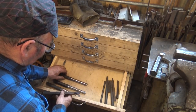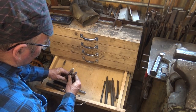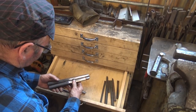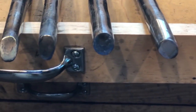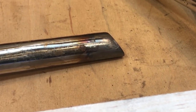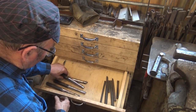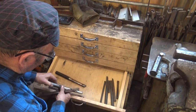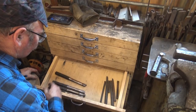These, on the other hand, we'll look at in more detail when we do some axe forging. This is an idea from James Austin — he actually sells some tools like this, though it takes a while to get them because he's really busy. These are somewhat of a chisel for cleaning up the inside of an axe eye that might have a burr or an uneven area in it. There's one oval and one round. I have just two sets of these for various axes, and they're made out of S7.